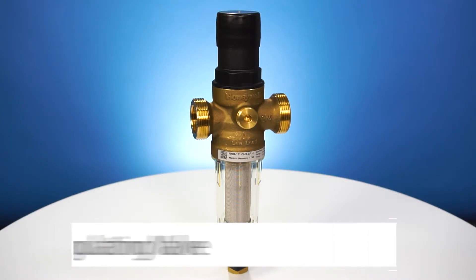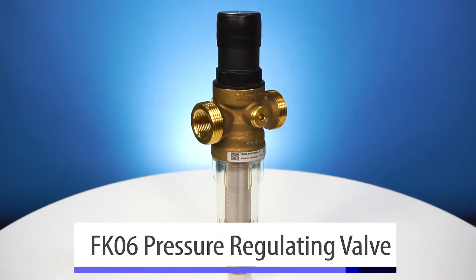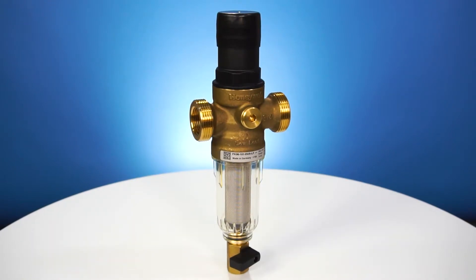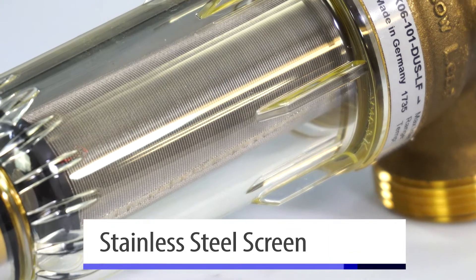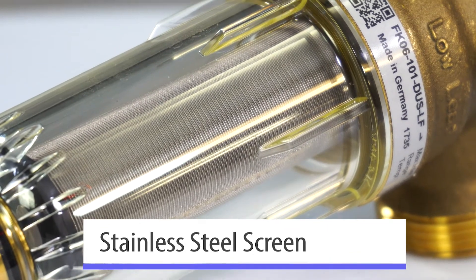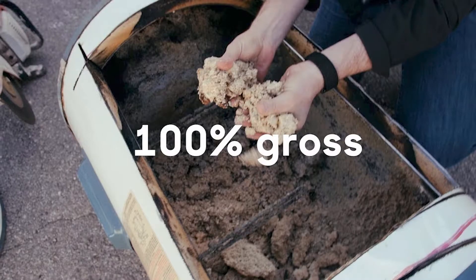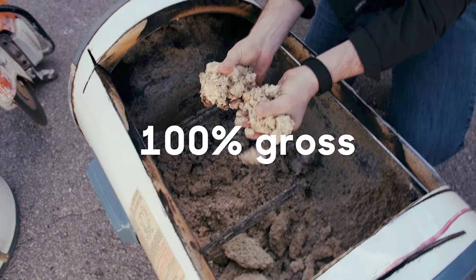We also have a version that's an upgradable version. Since we're seeing more and more tankless water heaters in the market, we came out with the pressure reducing valve with a 50 micron stainless steel screen. What this does is catch all the sediment and junk that flows through the pipe into your house and protects everything — so you don't end up with a lot of sediment in the toilet tanks, the water heater, or the tankless water heater screen. It really just protects it.